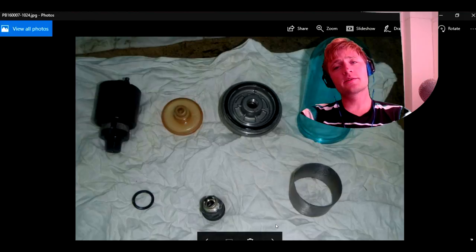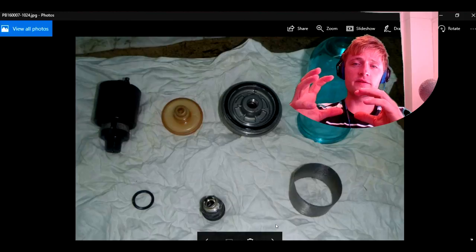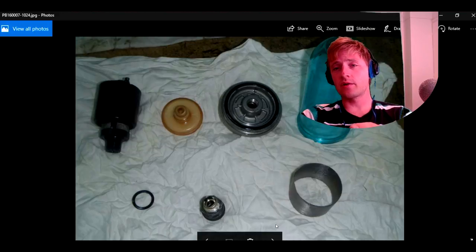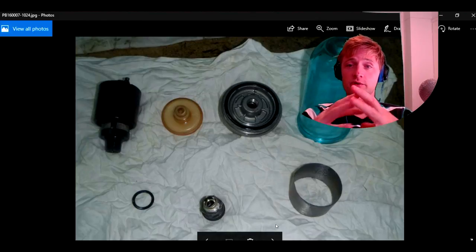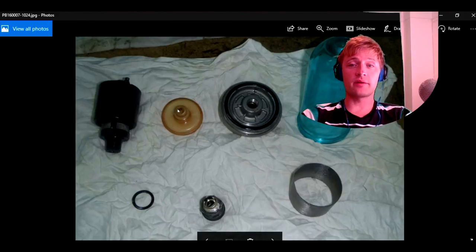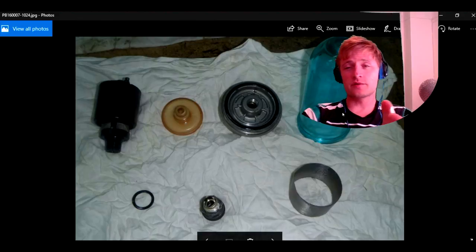This is how it looks. You can separate this auto drain, and it is better to have around 4 or 5 spare pieces for a 6-month voyage. If you have air dryers, they take the same system. You may have 4 air compressors — one service, one deck, and 2 main compressors — they all need these auto drains, so you need to have spares. This kind of auto trap has a lot of plastics inside and it is very difficult to repair. Even if the plastic breaks and you put some glue, it will break again because the air pressure is sometimes very high.